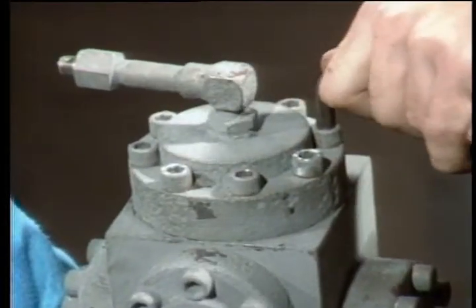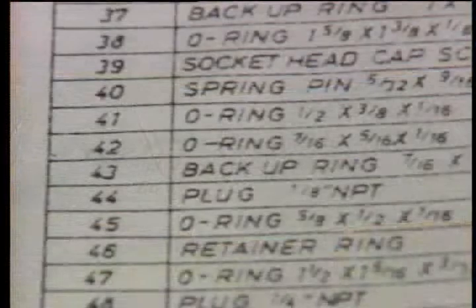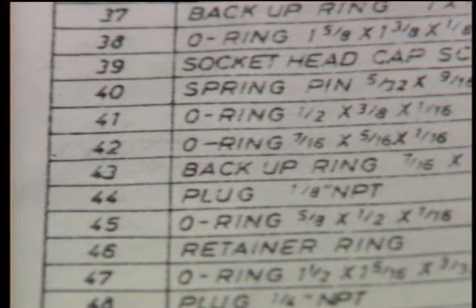But if you have to replace parts, you'll need part numbers. So make sure you know what supply pressure feeds the valves you're working on. Then pick up the proper valve drawing. It'll have the correct part numbers you need.